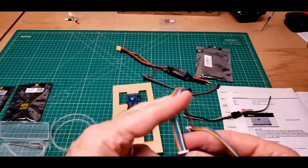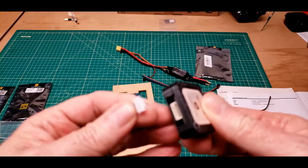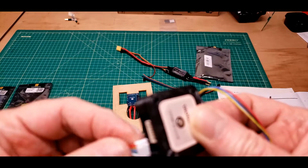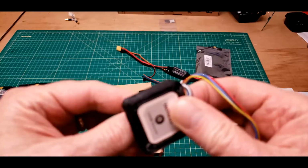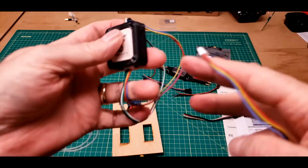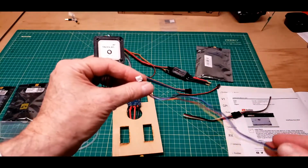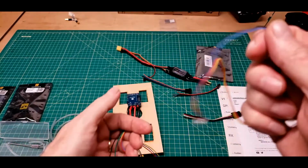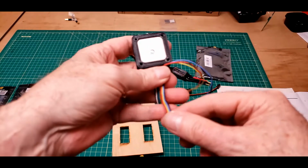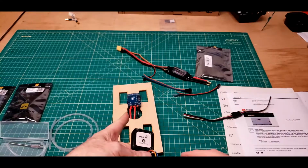Well, actually what I'm going to do is this cable that's the same connector on each end, I'm going to cut, and then I'm going to actually be putting this end back in the other side, not like I'm doing right now. It's an endless loop. You'd be drawn into the void. Yeah. First you have to be able to see, which is a challenge for me straight up. There we go. It won't be linked around like that. It'll be cut where it needs to be, and then 4 wires out of this connector that's for the airspeed sensor will be wired into 4 wires of that front port on that GPS module. Ding, ding, like that. Something like that. I think you understand. I'll show it in the next few days. And then this back wire being cut and having pins wired on it or soldered straight to the board like I was wondering here.